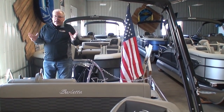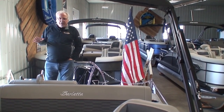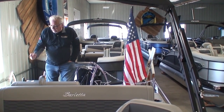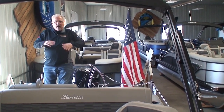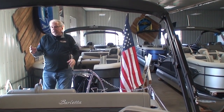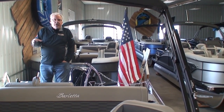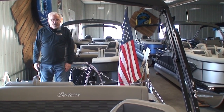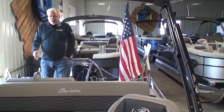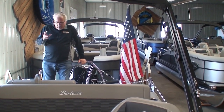First of all, the thing that I like about a battery on-off switch is I could have all my accessories on the helm. When I'm done using the boat, all I have to do is come back and turn that battery switch off and everything goes dead. I can't tell you how many times in the past when I didn't have a battery switch, I'd accidentally leave something on, come back a day or two later, and yep, battery's dead. Now I gotta charge it. So having a battery on-off switch or selector switch is wonderful. But the VSR. Okay, we got two batteries.